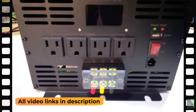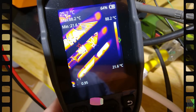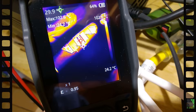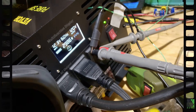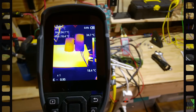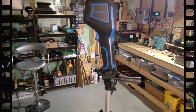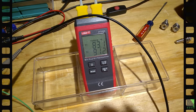In a previous video I did a hardcore stress test of a 3500-watt pure sine wave inverter, and I used the IR camera to look inside the inverter through the ventilation grill. I was able to see the temperature of the MOSFETs in real time without opening the inverter or disturbing the OEM cooling layout. I was using quad-zero gauge cables and I was able to see the heating of these cables in real time to check for any hot spots or bad connections — yet another example of where a thermal camera can be an indispensable tool for DIYers and solar power enthusiasts.